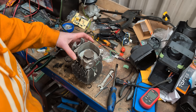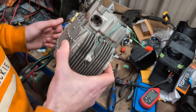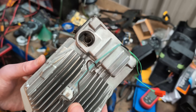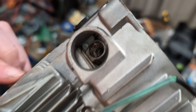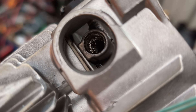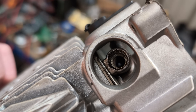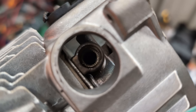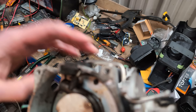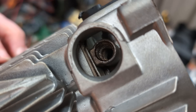I had a few people comment that because the heater was running out of fuel and not shutting down properly, if I'd let it shut down and run the glow plug, I wouldn't have the carbon deposits. You can see that mesh in there is absolutely spotless, because when the heater runs out of fuel and runs through the shutdown process and runs the glow plug, it burns off everything in there. It's absolutely fine — crystal clear.